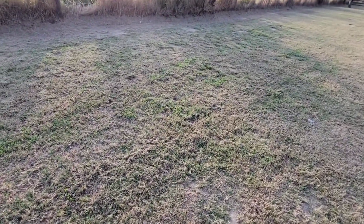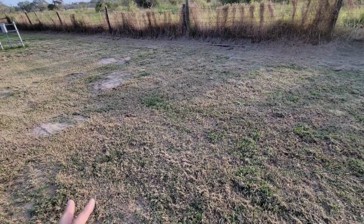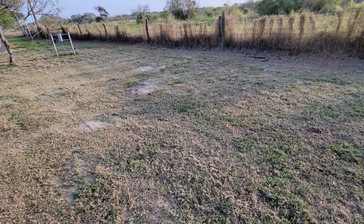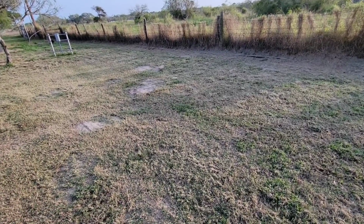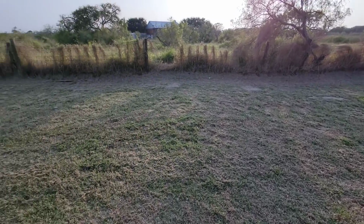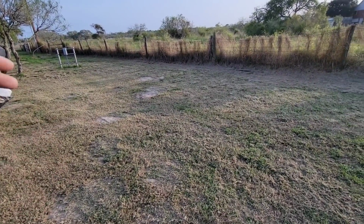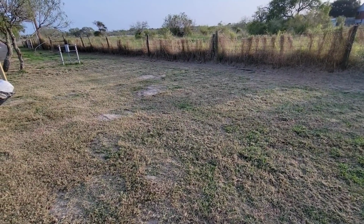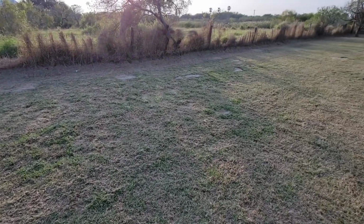And we're gonna let it sit for a while and it will start killing the grass off underneath it and creating kind of more of a stable platform, because it's still gonna be a while before we can get the RV on top of it. Any rain, anything else like that's just gonna increase that process and make it happen even quicker. But it is pretty much level. It's not exactly level, but it's pretty close to level, and the project today again is to get the geotextile fabric down, anchored in place, so we can start pouring the reclaimed asphalt on top of it and really trying to get this project going. So hang tight, we'll be right back.